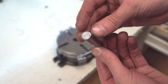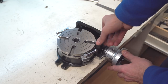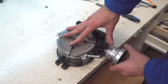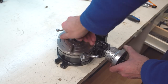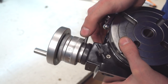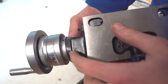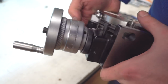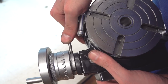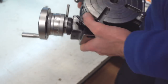There is another part I want to make new — a free-turning handle. There is a screw to lock the eccentric: just untighten it and the eccentric is free to move the worm away from the gear, meaning we can rotate the table freely. It's a nice function that saves a few turns. With the eccentric we move the entire worm axis and handle away from the table gear. The small limiting screw controls how deep the worm goes into the gear teeth — deeper means more precise, but too much makes it hard to turn and damages the worm and gear.